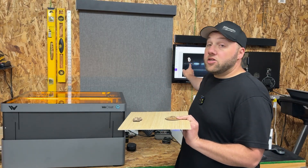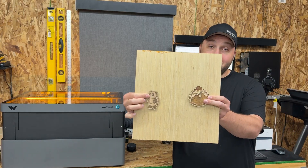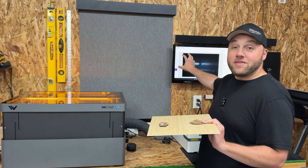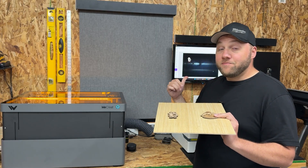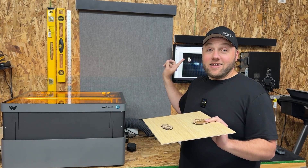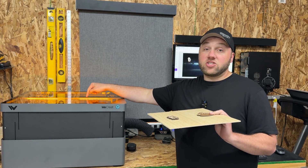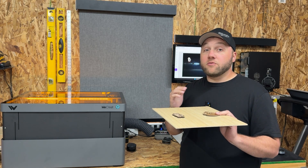What people will then do is take their engraved sheet, put it back in the unit, and hit autofocus. The laser head lowers again, and then the image on the screen — there's a panda on the screen — will shift just slightly. Your first instinct is going to be to grab that image and overlap it with the engraving so it lands perfectly from what it looks like in the software. That's the wrong thing to do. If you try to align it from the software but there's a different autofocus height because you slightly engraved some areas, that image is going to be slightly shifted because of the fisheye camera lens.